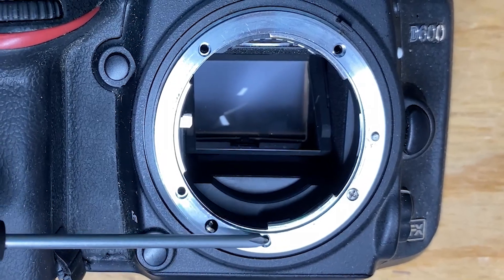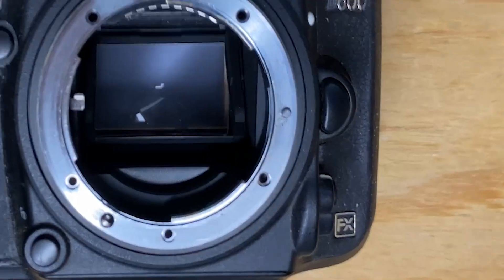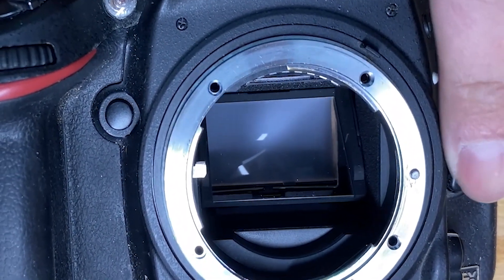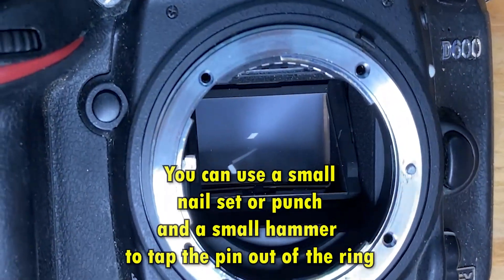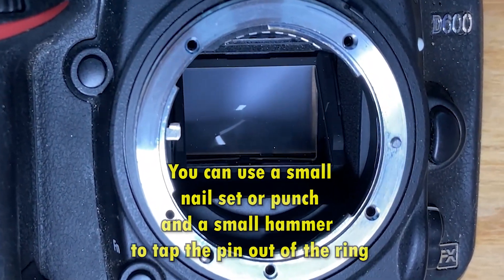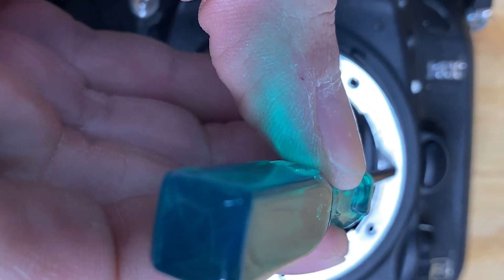Keep in mind when you take this bottom screw out, it's different than the other screws. When we get the screws out, you can watch — this pulls down the whole ring. And basically what it is, is this pin is stuck. So what I'm going to do is take a small screwdriver and tap on this to get it out. It's hard to do holding the camera, but I'm going to go ahead and just do it and show you afterward. So you can see I've tapped on it — sort of like knocking it out — and I'm getting that pin out.